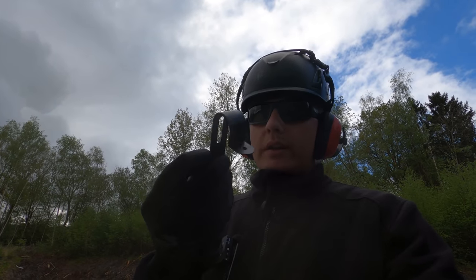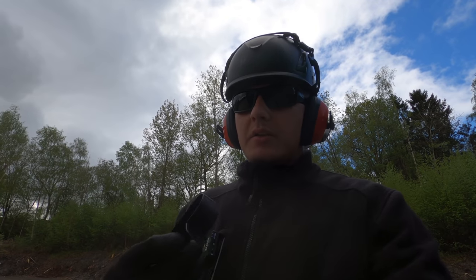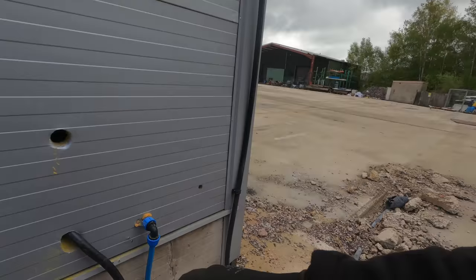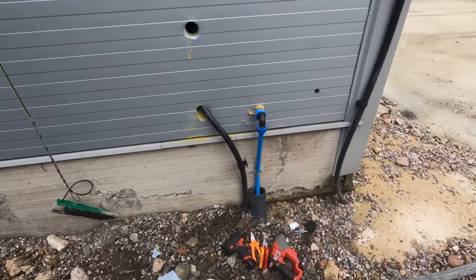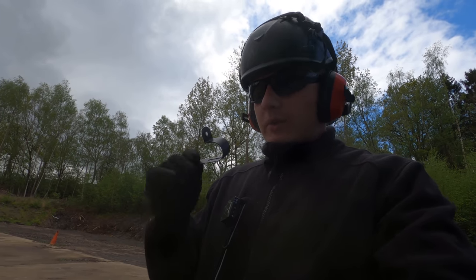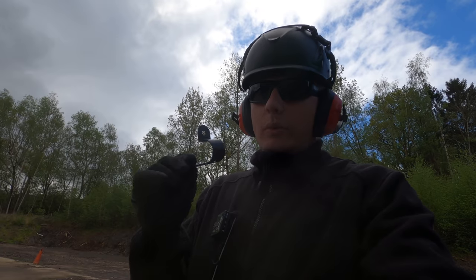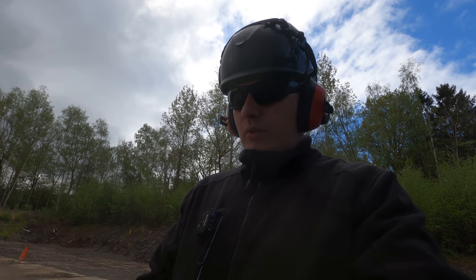We're using these firefly cleats — we use them as standard. Someone pulled me up the other day saying I was using these but not fire-rated clips. When I said we use them as standard, that just means in any application. I don't really need to prevent premature collapse of this one metre of armoured — no one's going to be affected by that, and it's next to a plastic water main anyway. But the point is you should use fire-rated fixings of course, to make sure you're stopping premature collapse. We just use these anyway because they're nicer than normal cleats, regardless of whether you need the fire rating or not. I'm going to put two on just to try and get as good a grip on the cable as possible.